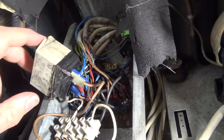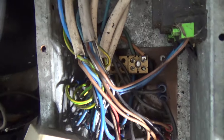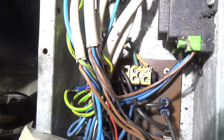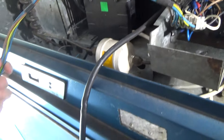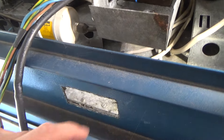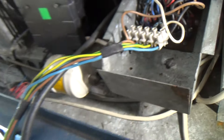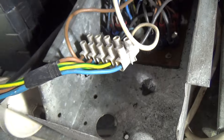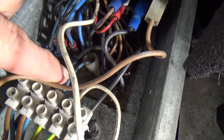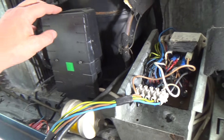We've got a relay. That's our transformer — that's all smashed. It's definitely been in the wars. And then we've got all this lot here, which maybe went to the new controller that somebody's sort of chopped into. I'm thinking that whoever did it didn't have enough wire and they've been using the earth wires as lives. Because that one goes to that relay here, and that one's got like a little crimpy wire nut on it. Fun times down on the farm.